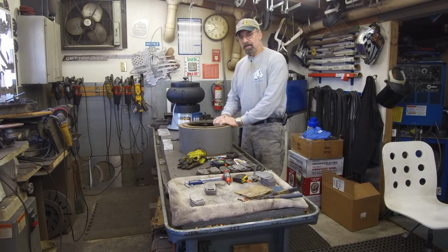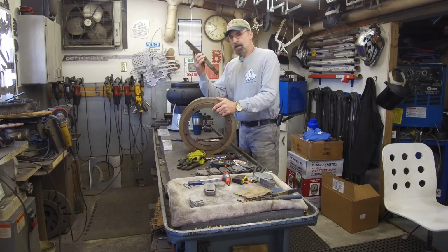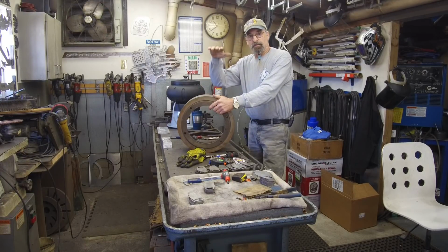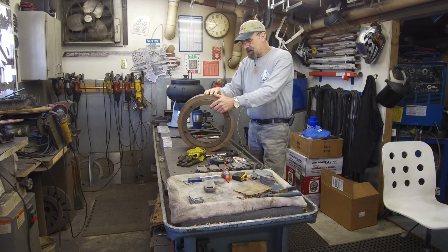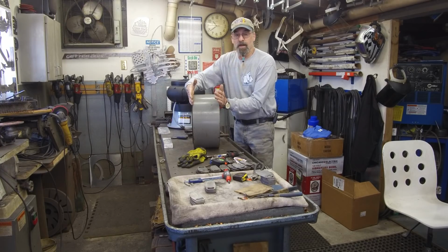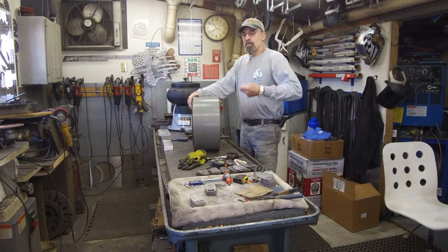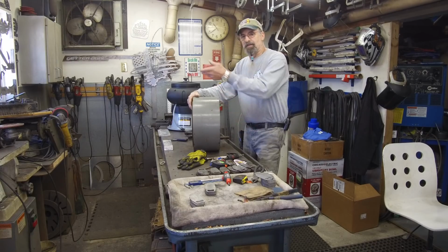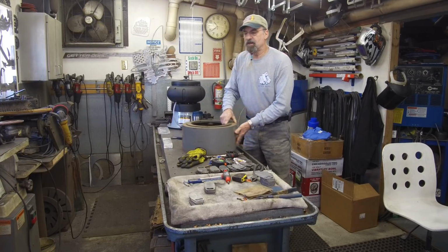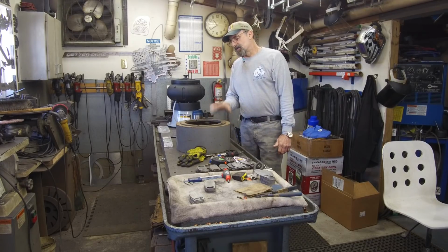Just 2 weeks ago, I picked up a 7-inch riser. This is the riser and the bottom keeper that holds the head up 7 inches higher off of the main column. From the base of the index head to the top where the jaws stick up, that is 7 inches. So this is going to almost eliminate any need to raise and lower that knee to compensate when going from a drill chuck to an end mill situation, where you're always changing back and forth and always have to raise and lower the knee to change out the quill. I'm really looking forward to it.